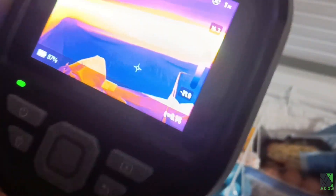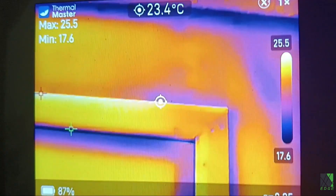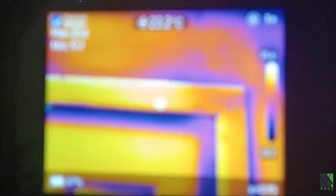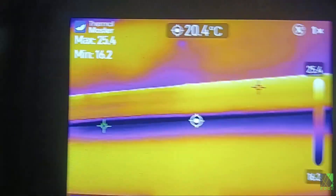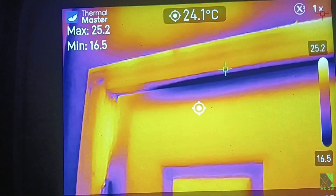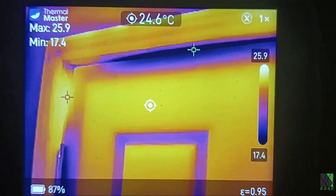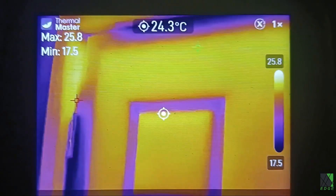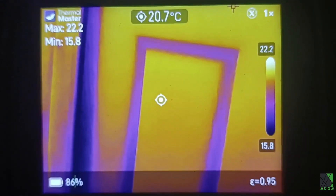Freezers are notorious for having thermal leaks. It's interesting to see cold temperatures too, not just heat. Most doors in homes today are poorly sealed and are usually a source of drafts and thermal loss — you can't really see that just by looking at them. As you can see here, it's cold outside and this door has a significant loss, pushing quite a bit of heat outdoors. The typical solution would be better weather stripping or lining the door up better. A thermal camera can literally save you money on utility bills if you know how to apply it.